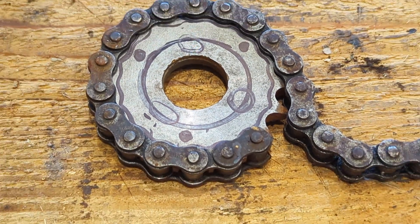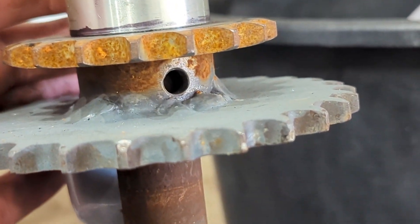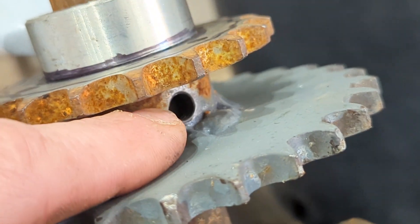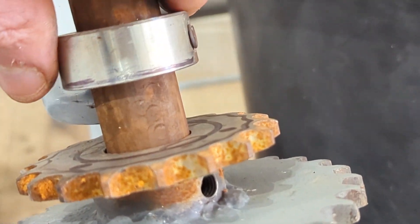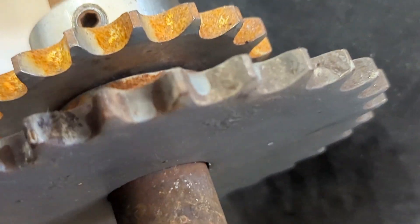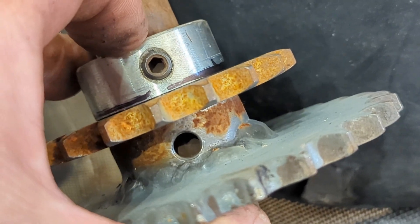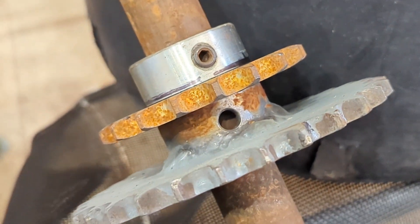This is the driveshaft off the old wind turbine — it's 25mm as well, so I just want to show you how it's going to look. Something to note: when this gets taken off we'll only have one place to secure the gear to the driveshaft. I think that'll be okay given the space limitations, but there will be more than enough space to attach a collar to the top, so there'll be two points in the assembly. It's just very tricky welding underneath there. I've got a custom-made allen key which is super strong, so that's good to go.